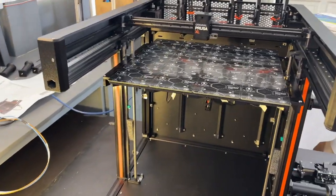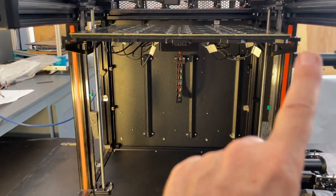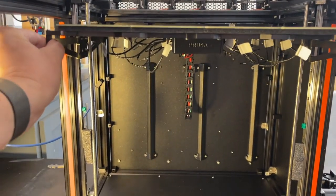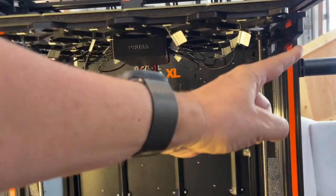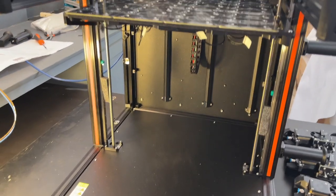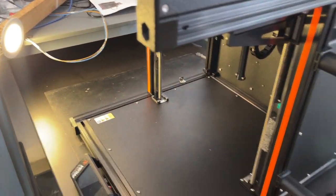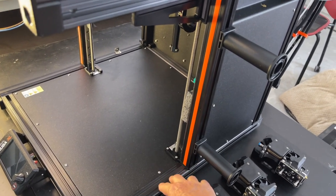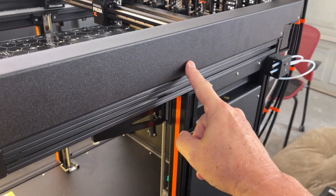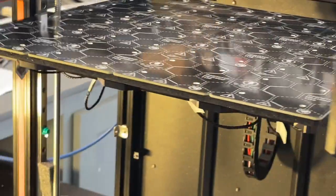The things to watch out for: first, these two arms on this side are different — one has more screws and is firmly mounted, the other is wobbly with fewer screws, wobbly on the right side. Next, a lot of the big problems in the comments come from the press-fit pieces. At the base it's not too bad — you torque it down and it press-fits into the extrusion. The bigger problem is up here when fitting on the Core XY unit. There is no gap between these two spaces, and that's important later.